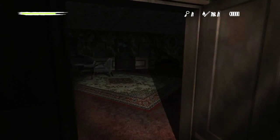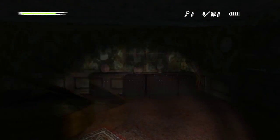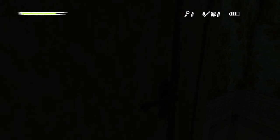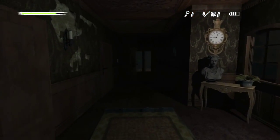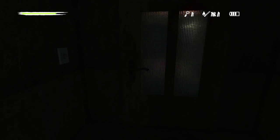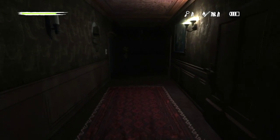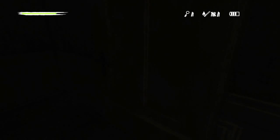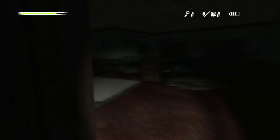There's a little rubber washer that goes on the underside of the sink side, and there's something called plumber's putty that you put around the underside of the lip of the strainer itself. Somehow, for some ridiculous reason, I actually had some of this — I don't know why I had a tub of plumber's putty and not a single goddamn wire brush in my entire apartment. It is a mystery.